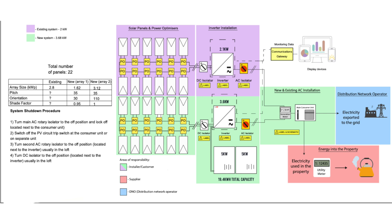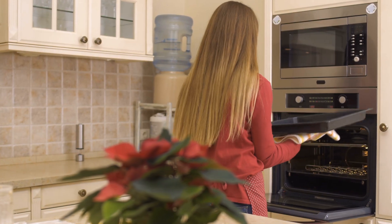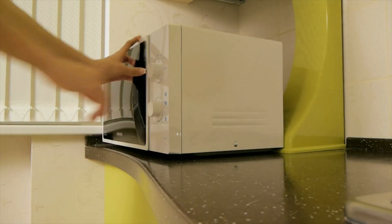Let me give you an example. I used to have two batteries, each capable of delivering 5 kilowatts max power — so 5 kilowatts each, a total of 10. But because my installer had put in a 3.6 kilowatt inverter, the maximum power I could supply to my home at any time was 3.6 kilowatts. This becomes a real issue when you're using high-powered appliances — not anything strange, things like your oven. A standard double oven, like a lot of UK homes have, could be drawing 3.6 kilowatts just from the oven alone. Adding any other devices like a microwave, kettle, or air fryer would draw extra energy, and because the inverter wouldn't be able to supply them, you'd have to draw that power from the grid — even though you've got capacity sitting in your batteries.